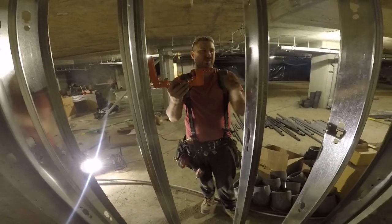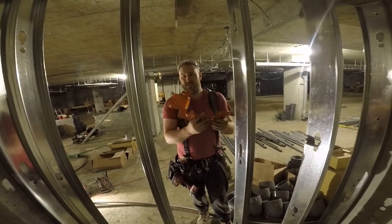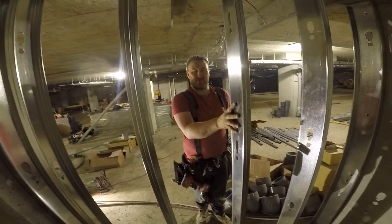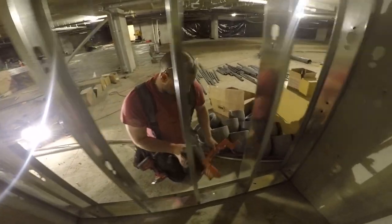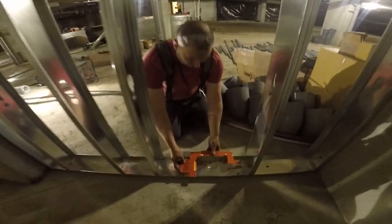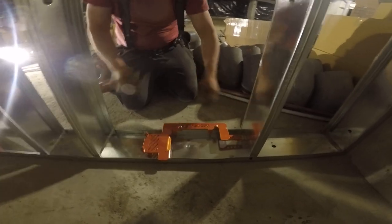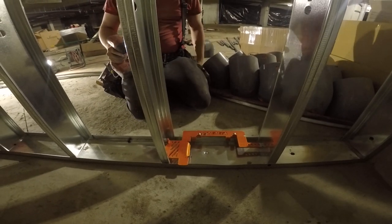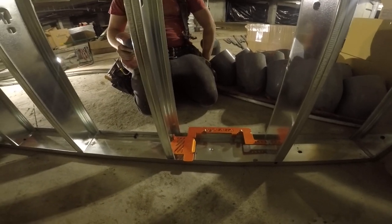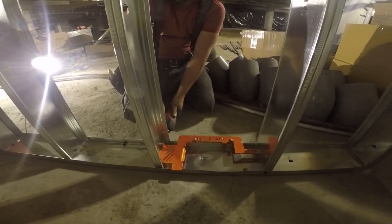You want to hit the stud that's already square because you want the magnets to secure these in place, right? So a light gauge stud, right? This thing just clips onto the track here and just boom, just touch the stud, right? Clamps in and it's perfect on the center here. Right, and now the front and back are good to go, right? You can screw both in.